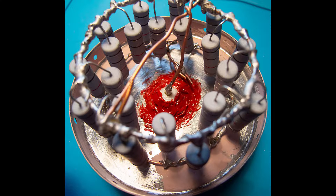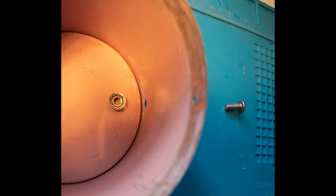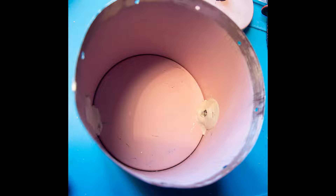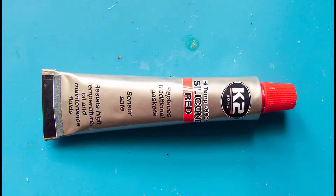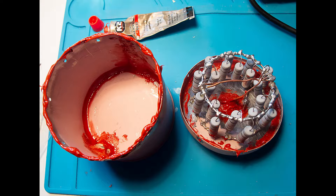The oil filling port is made of a nut and a screw. The nut is fixed into position using epoxy putty. The rest of the epoxy putty is used to fill other gaps and cracks in the bottom of the can. After that, the inside of the can is sealed with silicone, applied to the edge of the can and around the inside of the lid. Both are put together and then secured with 8 rivets around the lid.